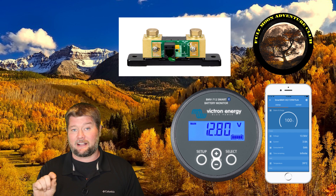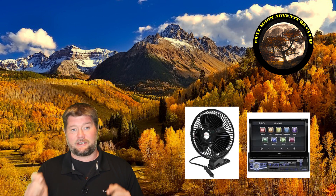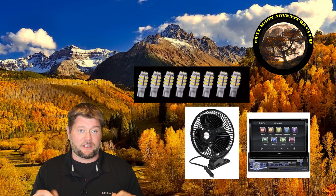To figure out if these actually deliver the full amount of power they promise, we're going to put a 5-amp draw on these and set up a camera to take a picture a minute so I can see exactly how long they last. We're also going to be using a Victron battery monitor system with a battery shunt to tell us exactly how many amp hours we get out of these. To get that 5-amp draw, we're going to turn on the RV stereo with a small LCD screen, a 12-volt oscillating fan, and a whole bunch of LED lights. I'll verify that with a multimeter and the Victron readout.